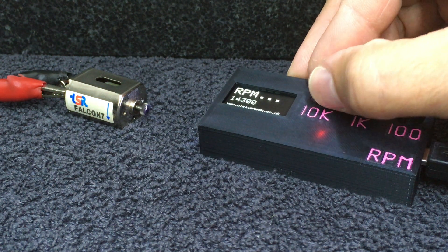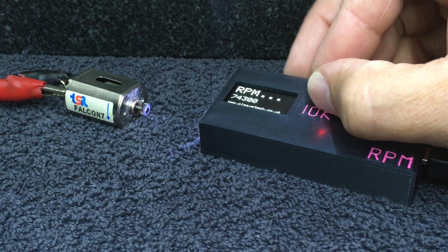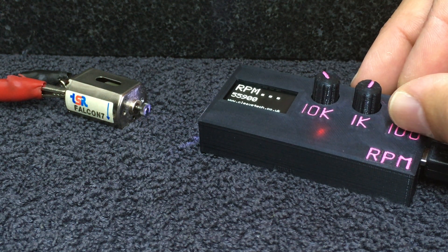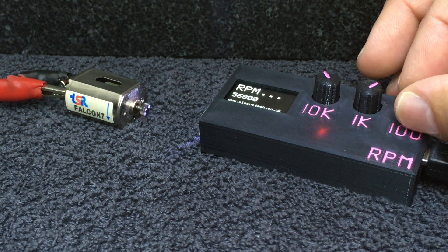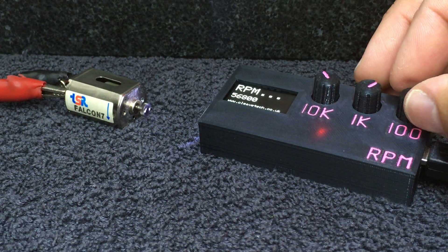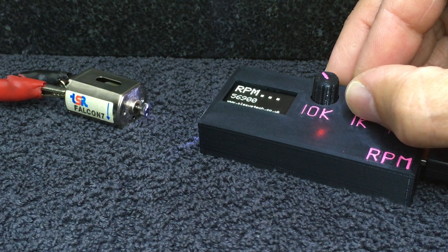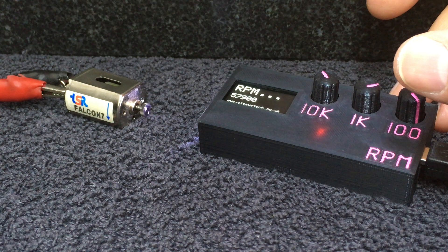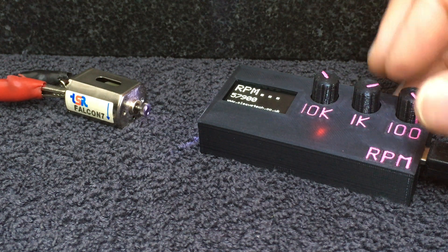Let's show you the other way. Let's say I doubled that 28,000 RPM that we had before, so let's go up to something like this. The motor has picked up a little bit in speed. If I double it you can see that we get two white dots. That's because this time the strobe is flashing twice for each rotation, so you can see two white dots.